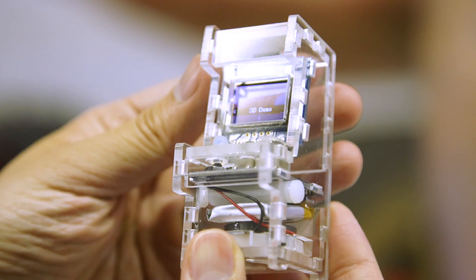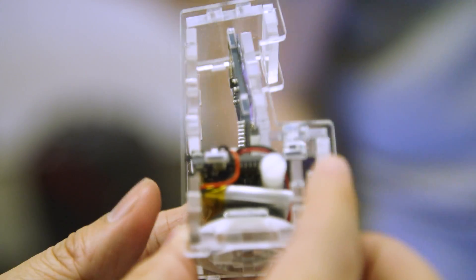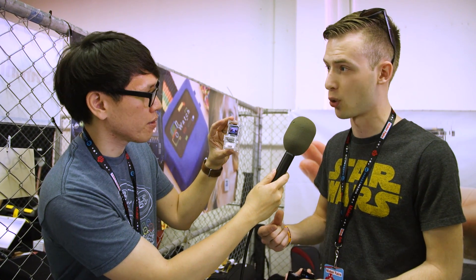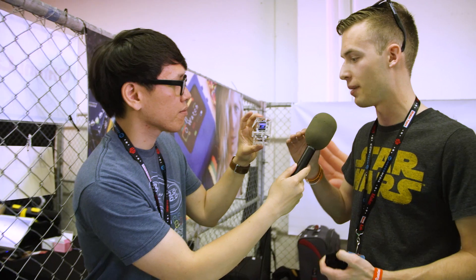I love it because it's clear acrylic which shows off the components. While this is a product you guys sell, what you really make is everything that goes inside the tiny arcade cabinet — your Tiny Circuits board and all the stackable board system. Tiny Circuits was founded when our founder took an Arduino Uno and shrunk it down to the size of a quarter. We've kept growing using Arduino-compatible parts. This is based on the SAM-D21 — it's an Arduino Zero processor, essentially — and we designed the board and manufacture it all in-house.